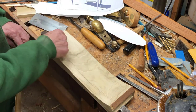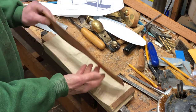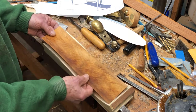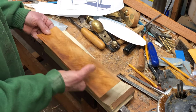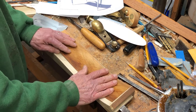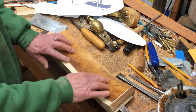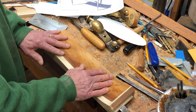I've cut a piece of crotch cypress that will be the center panel. Now, a lot of times with crotch veneer I press it overnight with some moisture and it flattens quite a bit — that does help. But I think I can get away with doing this without flattening it. It's oversized and I want to place it about like this, then trim it while it's still wet to the proper size.